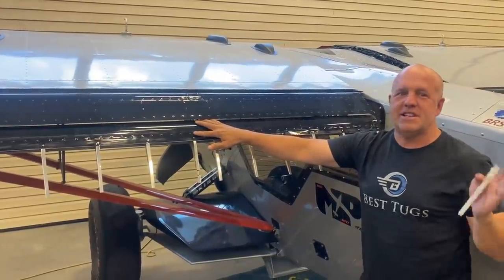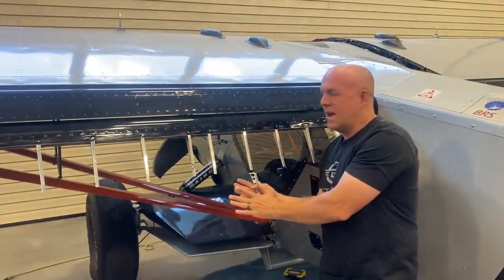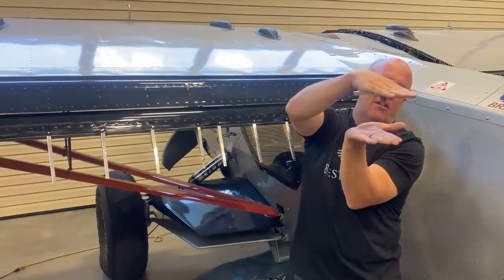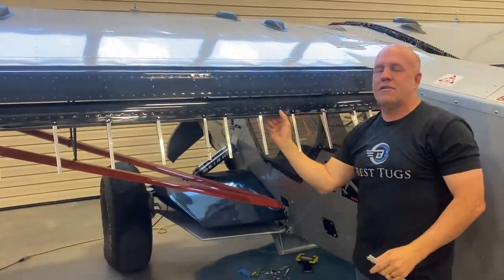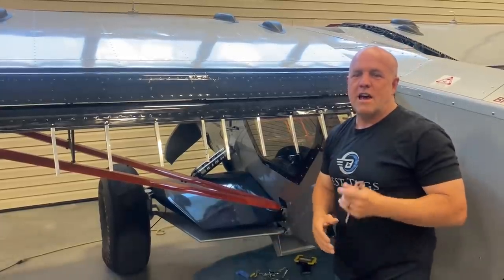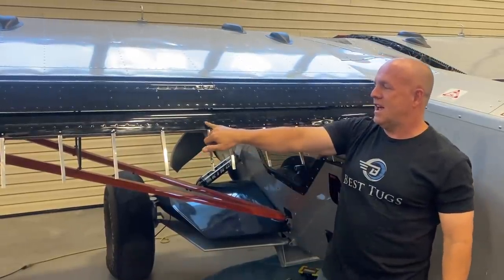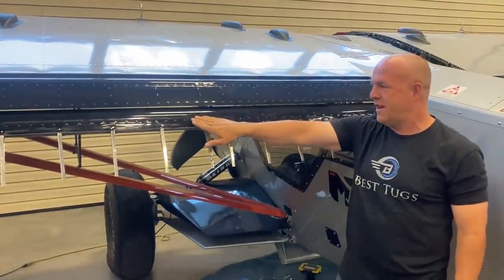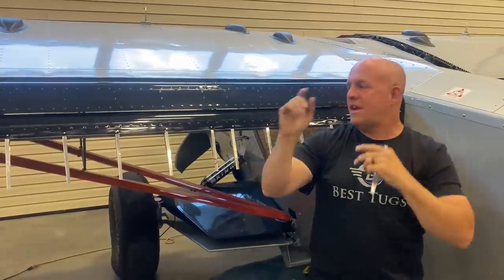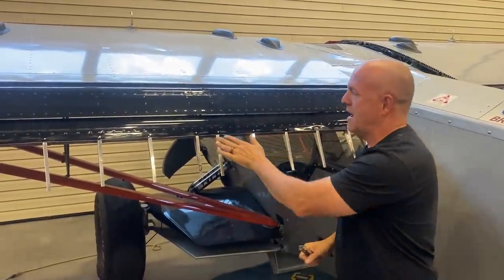Pulling this apart was actually really easy - it took several hours. We just had to drill it all out, and then I cut the original skin back. I didn't want to just add on; I would have been adding weight by just extending the old one, and the angle of the pinch on a short one was different - I had to open it up to get it to go longer. I wanted it to be aerodynamically correct, so I didn't just want to slap on a piece of metal to the back. We made new ribs. I went ahead and didn't take out the rivets on the bent front part. I thought it'd be nice to leave this little trim at this line and be able to put two skins together without a step - just make it aerodynamically cleaner.